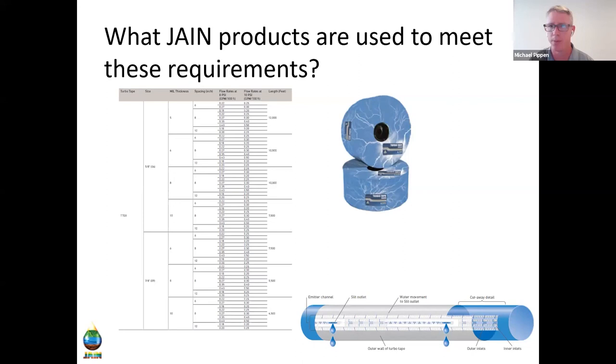So we've got the two different Chapin models, BTF and Deluxe, being a little bit better towards water quality issues. Cascade is really our discrete emitter product. We use it with sand and silt problems and water quality. We really do use a lot of it in our SDI market. And then the Turbo Tape is used primarily for crops that require really close spacing, but we want some lower flow rate. So we have a 6-inch 2.5, we have an 8-inch 2.0, some really pretty low flow rates for a spacing that tight.